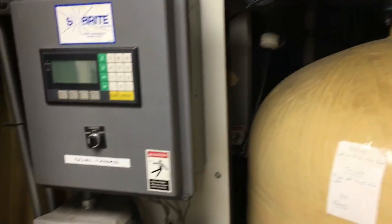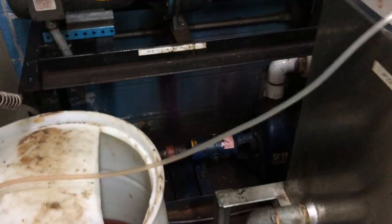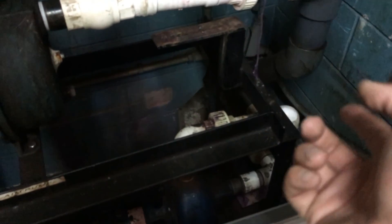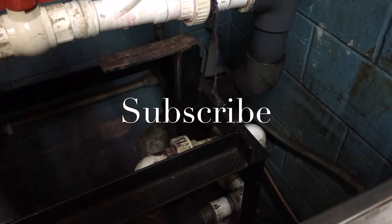You can see this is the room for the recycle machine — two large tanks, one on the right and one on the left. That's an odor pump, solely used for odor control. These are the pipes that lead outside. We have the reclaim pump — the most important pump in the whole car wash — right down here. That's the pump we rebuilt. You can hear water moving because we're sucking the water out from outside. When the owner shuts down, that water which is supposed to stay in the pipe is slowly draining back into the holding tank. When the pump — a Gorman Rupp, one of the nicest pumps you can buy — kicks on, there's air mixed with water, and that's what's causing the pump to break down faster than it should. That's basically how the whole system works.